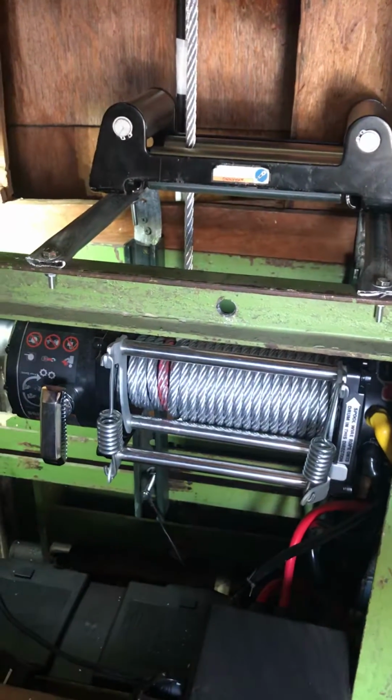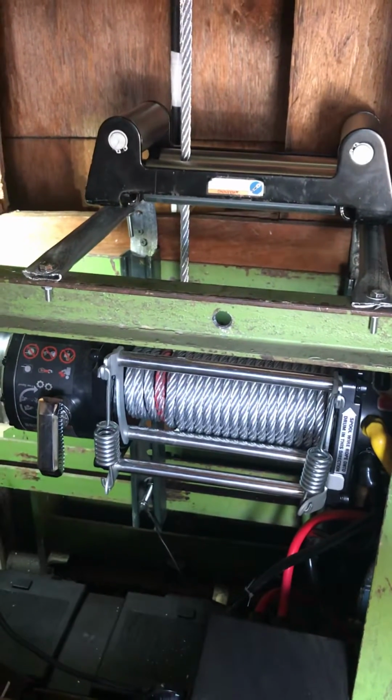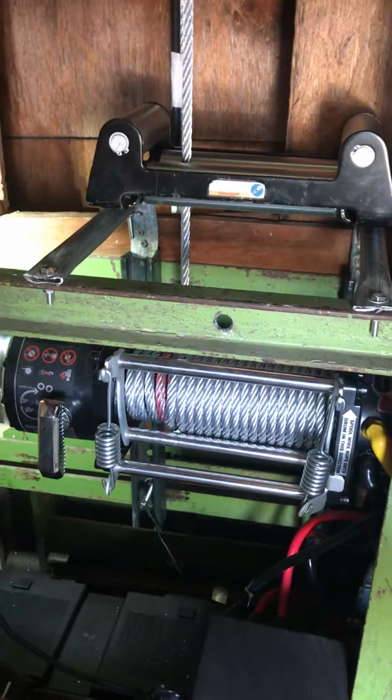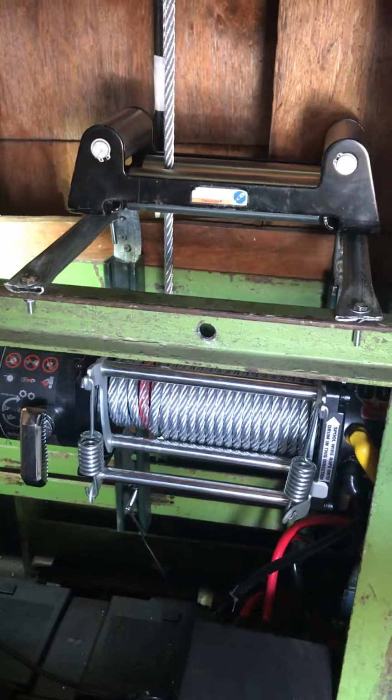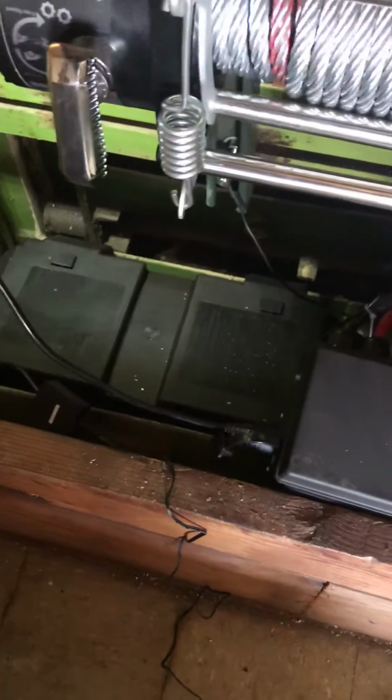The issue was with the power supply. It's 300 amps at 12 volts, which is a 30 amp feed, and then you've got to get a power supply, and that's going to be quite expensive, probably over $1,000. So what I did is put a battery down there for a little over $100, put it inside a sealed case.